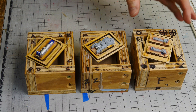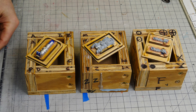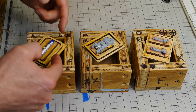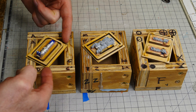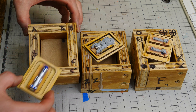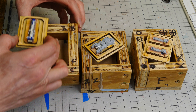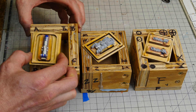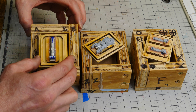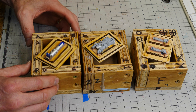These are our three plates going into the little mold boxes I've made — I have videos on that as well. I'm going to take a couple sides off, wax up everything, put a little clay around the edges, and drop them into the mold box. They fit pretty tight already on the inside, so after we put the silicone on top we'll be able to pull out the bottom piece, remove the cardboard, and pour the silicone on the other side.